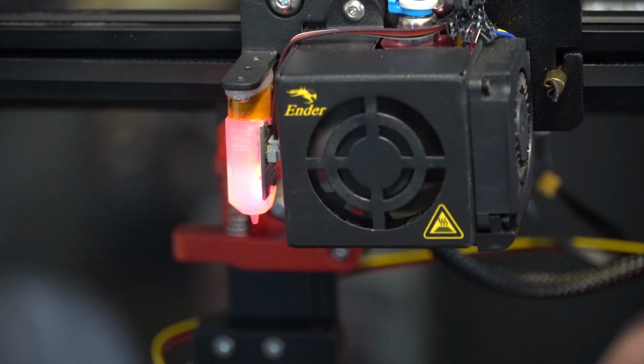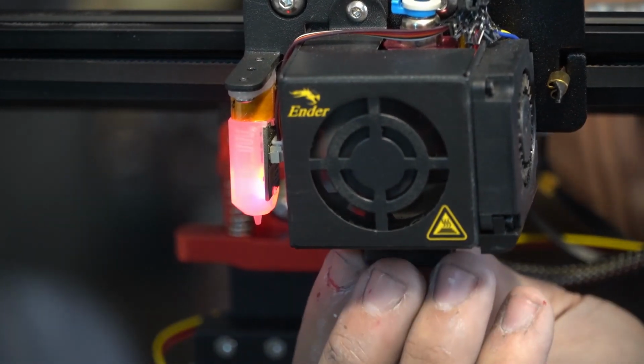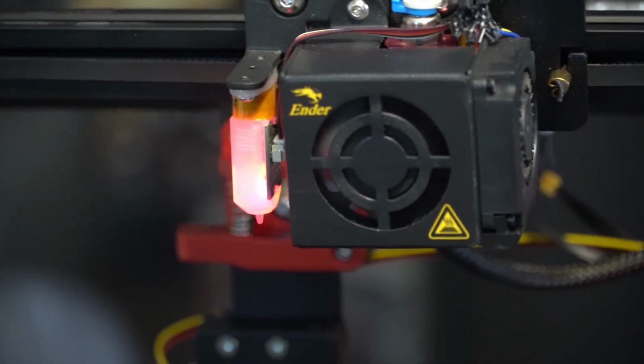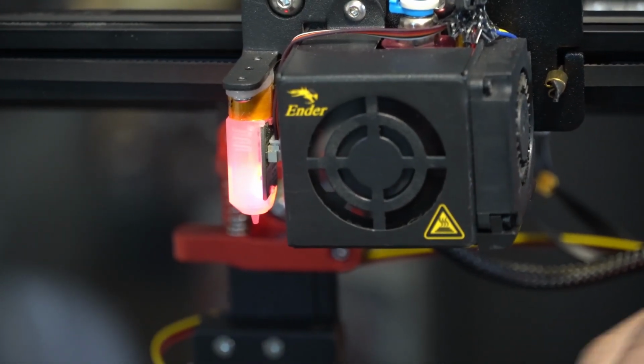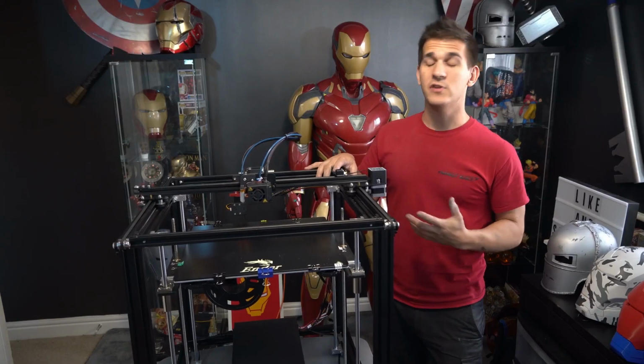The nozzle's back on. So you can go ahead, throw your thermal sock back on. Again, don't burn yourself, please. And that's ready to go. You just upgraded or swapped out your nozzle. So I like my 0.6 mm, and I think that's what I'm gonna run with for quite a while. So those are my 3 upgrades done.